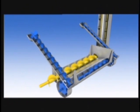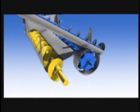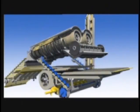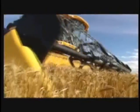Tailings are handled by a double rotor return system. With interchangeable lugged or smooth covers, the rethreshed material is then spread evenly over the full width of the grain pan. Now to the concept of centrifugal force, which is the key difference between twin rotor combines and any other type of combine.